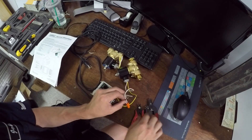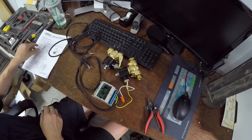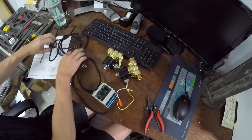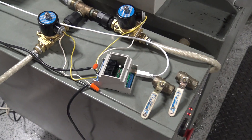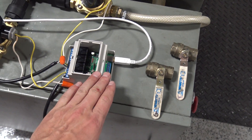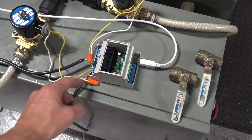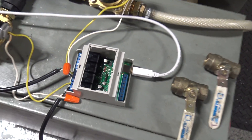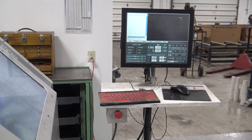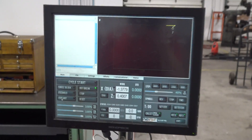Power line is coming in. Let's wire one up and double check — Common is from the power cable and then goes to normally open. This is already connected over, so let's just go try it with one and see if she works. We're wired up. From a safety perspective, I've got this exposed now, but we'll obviously enclose all this and keep it away from the liquids in case there is a leak, and I'll wire electrical tape around these wire nuts. You can see the blinking light. Most of the time it's worked when we just plugged it in; once I had to actually reboot PathPilot for it to talk to it — just a tip in case you have that problem.